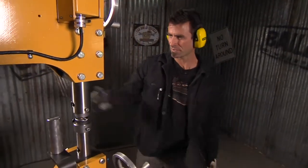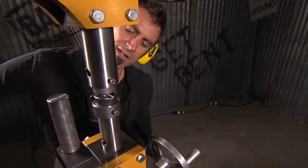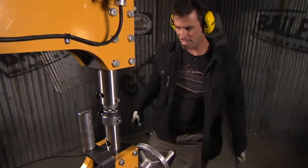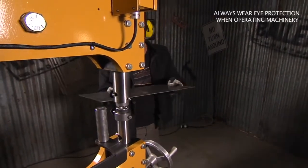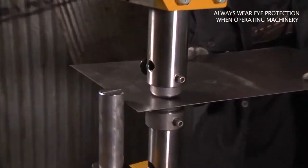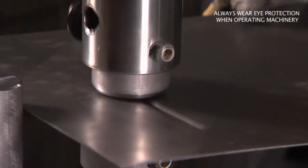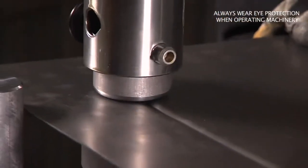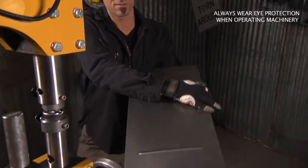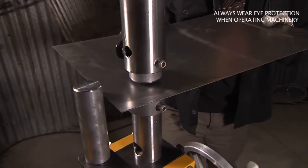And at that point, we check our height. So we kind of see how we're looking. So we've got a metal thickness in there. We'll do that by spinning it around via the wheel on the opposite side. At that point, we're ready to rock. So cool thing about this too, you can start in the middle of the panel. So I'll start that. See how smooth that is? Now say like you're doing a floorboard, you know, floorboard would kind of look similar to this.